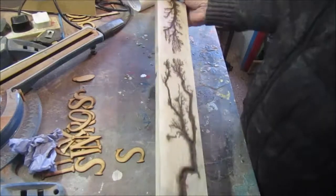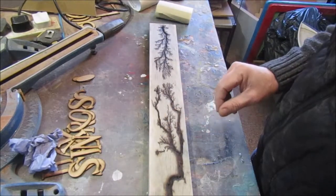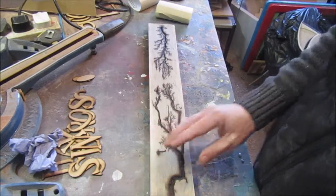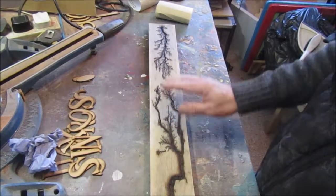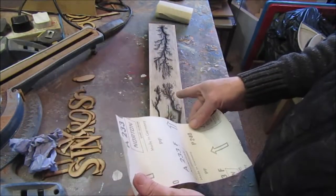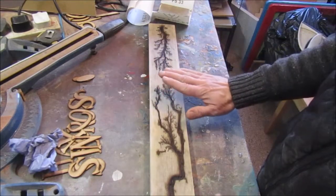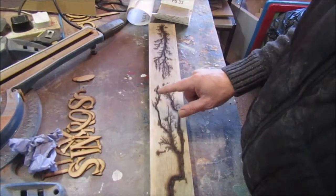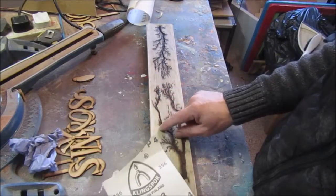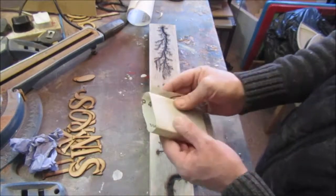Okay, here's the piece all dried off. Still warm. Feels like it's just out of the oven. Now here's a wee tip for you. If you aren't getting the finish that you're looking for when you're working with wood, what happens is the top layer of grain gets flattened, and as soon as you introduce any moisture, it rises up. So if you sand down any bit of wood to whatever grit your favourite flavour of sandpaper is, I took that down to 240, and it will feel flat as you like. As soon as you put your finish on it, the grain rises and you won't get the finish you look for. So I'm now just going to hit this with some 400 very lightly, because I don't want to take away too much of the fractals. With me washing it out, it's raised the grain. Now I can just take it off very lightly.